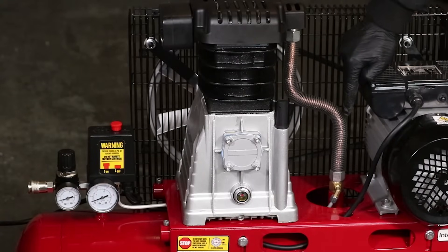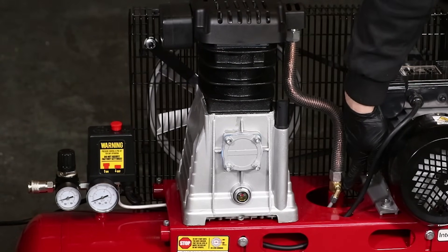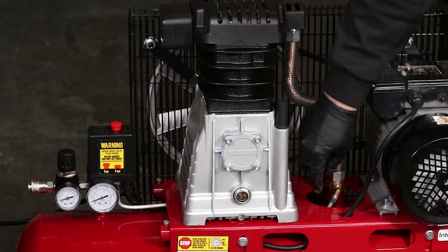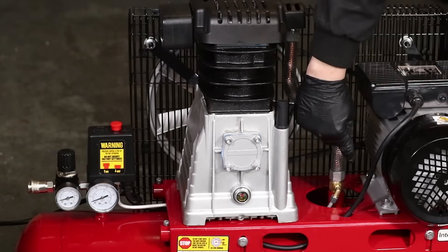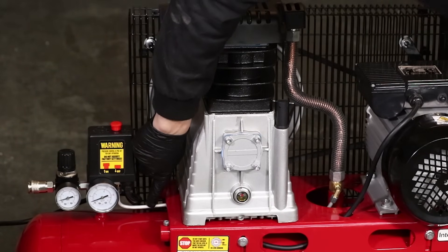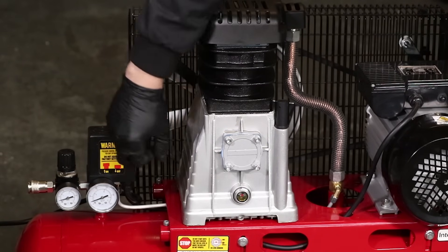When the air compressor pump is running, air is pushed through the main charge pipe, down through the check valve, through the little rubber piston inside the check valve and into the air vessel itself. If the check valve isn't sealing correctly, it'll allow air to escape through this tube and out through the bottom of the pressure switch.